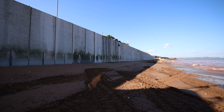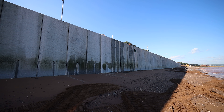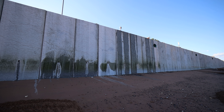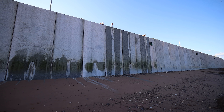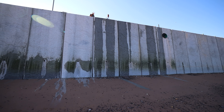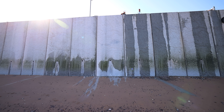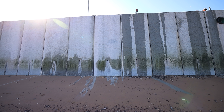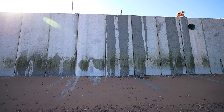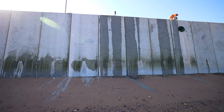You can see the guys at the top there — they're harnessed onto a system on the opposite side of the wall. What they're doing is coring in front of us, placing the recurve units. Each recurve unit has four dowel bars which are cored into the piles: one facing panel shares two piles, one recurve unit sits over two piles, and there are two cores in each pile. They core down roughly about a metre and a half into the concrete, and then when they land the unit they grout the bar in, and that's what fixes it in its permanent position to the piles.